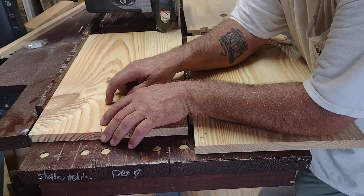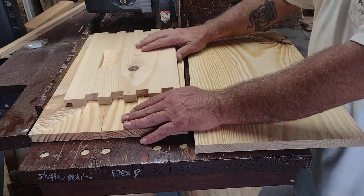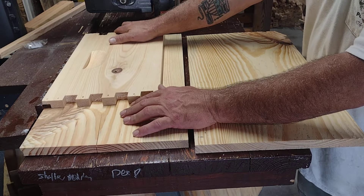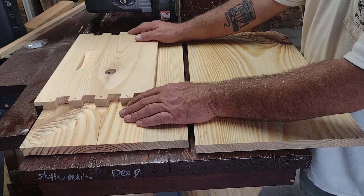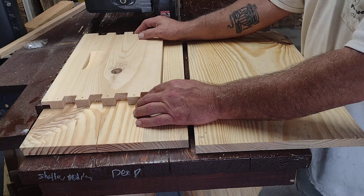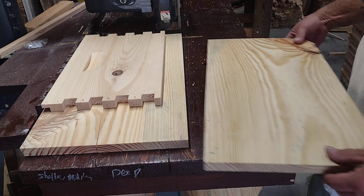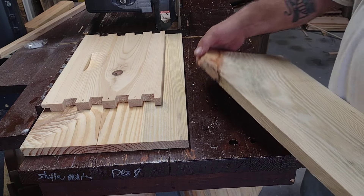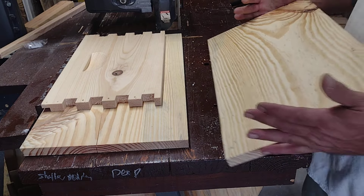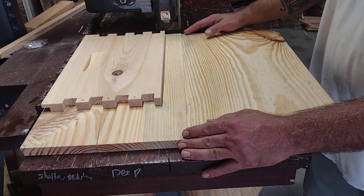When I go through, I'll be looking for boards like this one here that's cracking, so that's automatically going to become a short side because I can cut the crack out of it. I'm also looking for knots — I can pretty much get rid of that whole knot. The crack on this board here means it's a short side; I only edged this side because I'm going to cut that out.